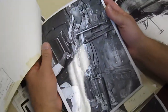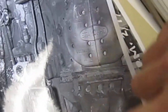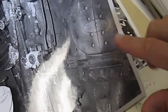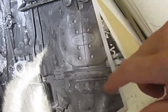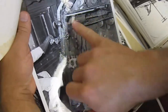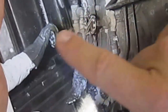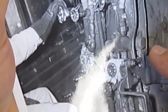Here's the fireman's side. This is where the coal enters the firebox down here — this is the stoker assembly, standard stoker. Coal enters up through here and then it gets sprayed out into the firebox. This is a door to manually open with the air assist valve, to look in the firebox or add coal by hand. Here again, here's the blower lever right here. Here's the check valve on the fireman's side for the injector coming down. And these are all stoker controls over here.